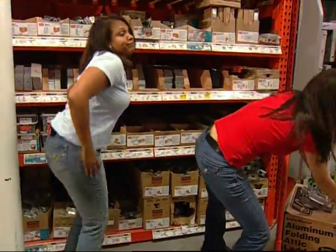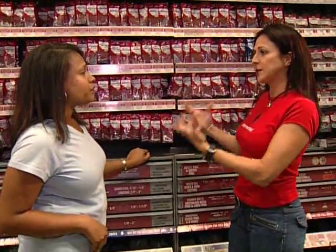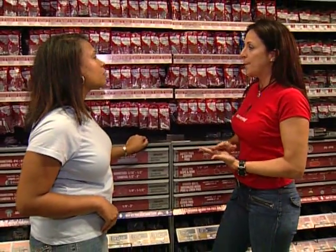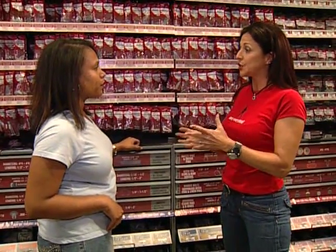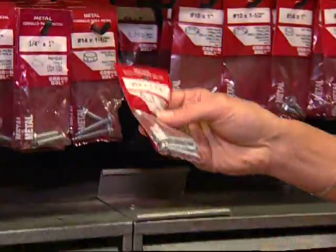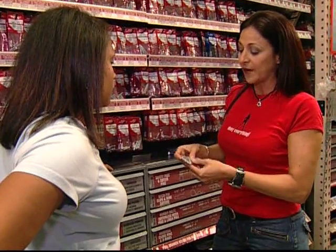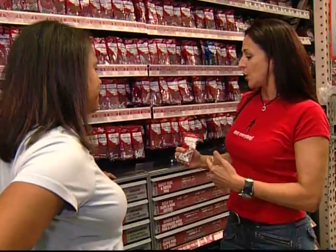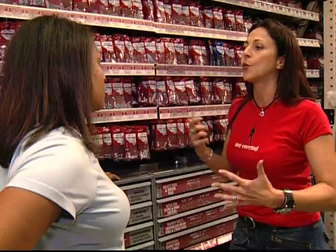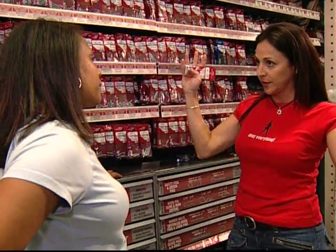Excellent. We're moving on. We need to get something to screw or nail those joists in place. We're going to use some nails, but because we're going to be working in a very tight space, I think it might be easier to use screws if we don't have room to swing a hammer. So we can screw easier, but when you're buying screws for this kind of application, you want to make sure that they're wide enough, because some screws can be very thin, and if that screw breaks, it's not holding anything in place. So you want to make sure that it's wide enough and deep enough. This is 1.5 inches long. So I want to get a bunch of these and some nails, and we'll see what works best, what's easiest to use, but knowing that either the nails or the screws will be strong enough to support the ladder.